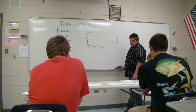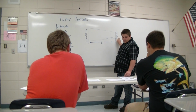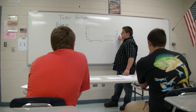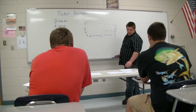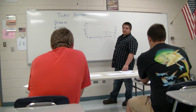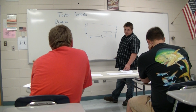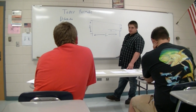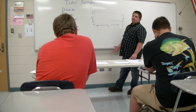Anyways, what they're saying is you're going to take your big diameter and subtract your small diameter from it. They gave you an inch for the big diameter, and 844 thousandths on your small diameter. That's going to give you 156 thousandths. You're going to multiply that by 6 and come out to 936 thousandths. All right? Then you're going to divide it by 6 because it's 3 times 2 on the formula. That's going to give you 156 thousandths as well.